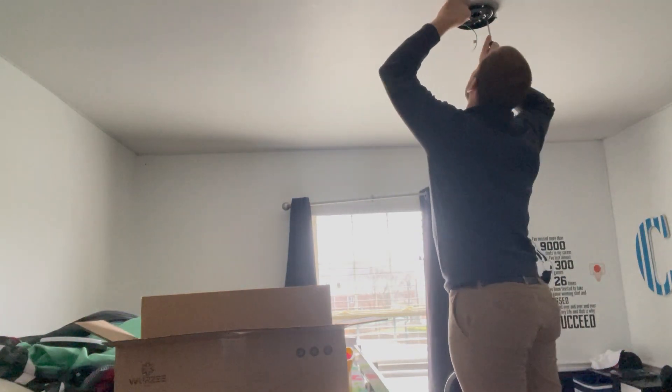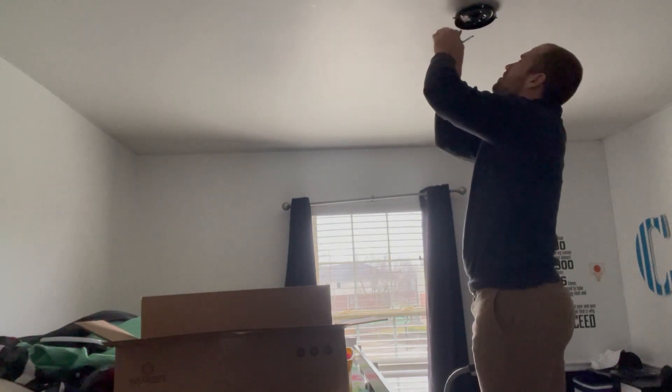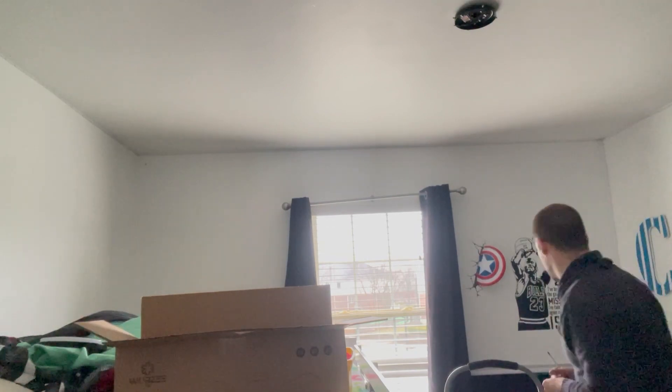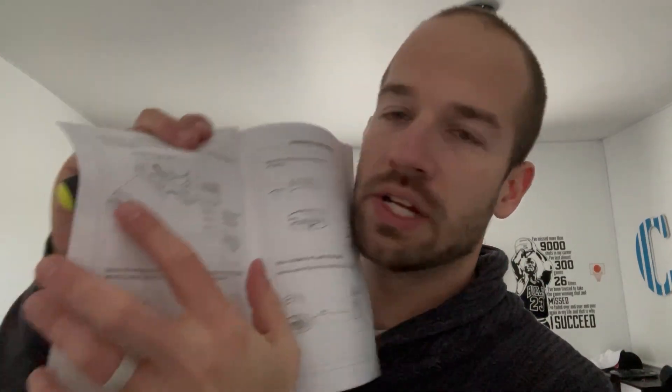Once that's secure, try to push down on it and make sure it doesn't wiggle at all, because you're about to put something on it. It looks like there was an extra ground wire — that probably goes with the old fan, or they left it when they replaced the light. I don't know why it wasn't connected to anything. Again, you cut off power. Now, once that's on — second thing is put up the decorative ring before you put up the big unit. If you put the big unit up before that, the decorative ring isn't going to fit around it.